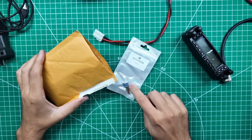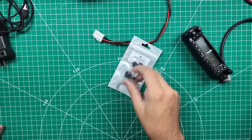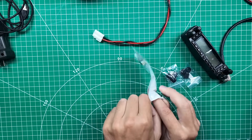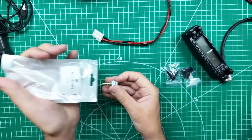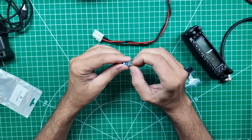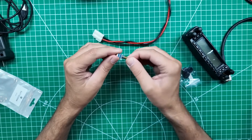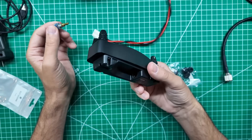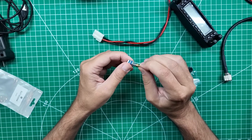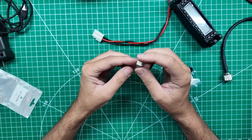Here is the package that I got — there is the rotary encoder itself, and there are two packs of knobs. I actually did a repair very similar to this on my Yaesu FT-891, and there they called it a VR unit. The outside moves and the inside moves — both parts are good there. It feels a little metallic, but this encoder here is old and might be a little better worn in. This is doing the thing, and you can see all of the pins there, so we might need to do some soldering.